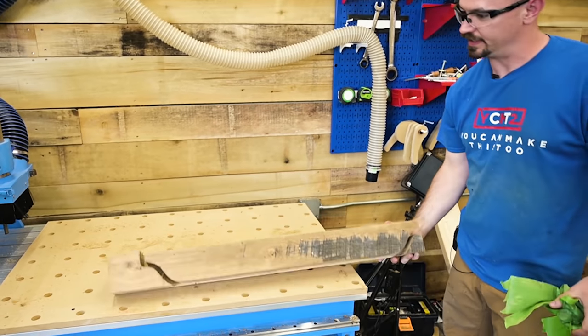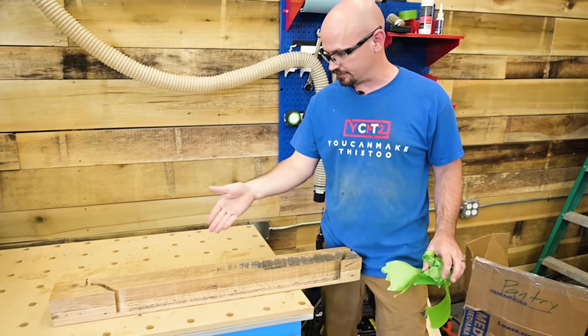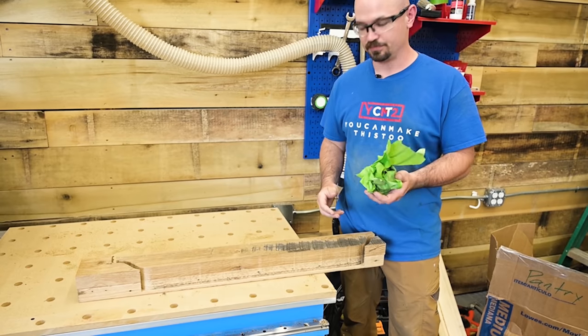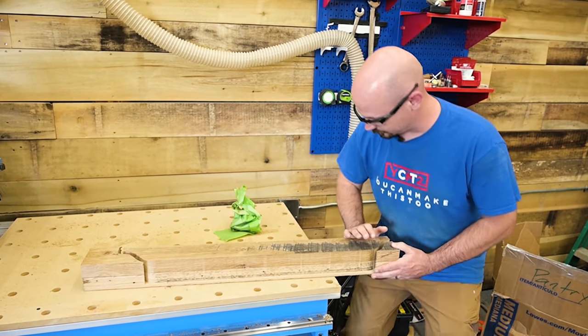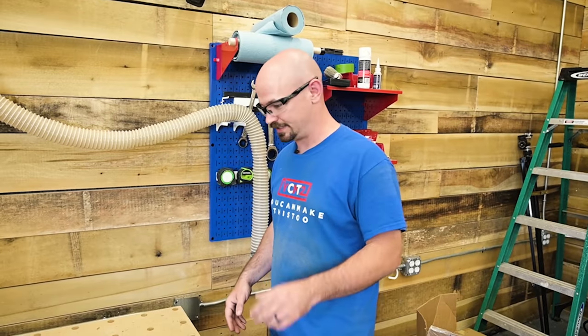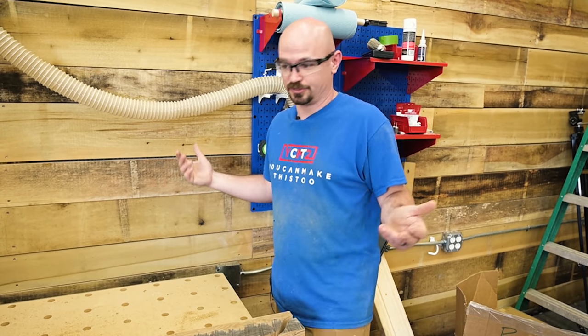It works beautifully because with the shear action of the CNC, just pushing laterally, it's not gonna break the hold. But the adhesive on the tape isn't strong enough that if you get a little angle on it, it rips right off. You just run through a bunch of tape and CA glue when you do it, but when people send you all those things for free, who cares how much you use?